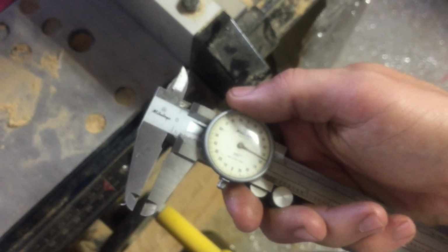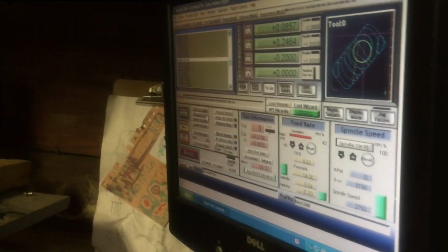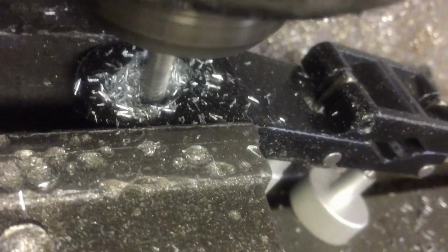Let's do some measuring. So there's the new rosette, right? There's the feature that it has to accommodate, that square. Calipers, 0.155-ish. All right, so now we're at minus 0.2 inches. So 200 thou, and I think that's where I said to put it, which is obviously more than 155 thou, which is what this measures out to, but it's probably more than I need.